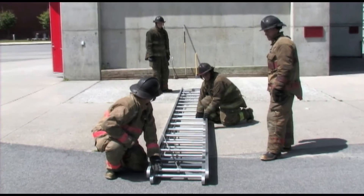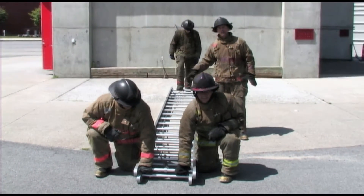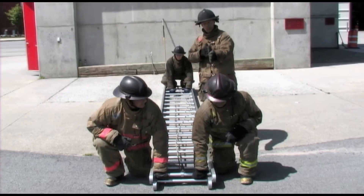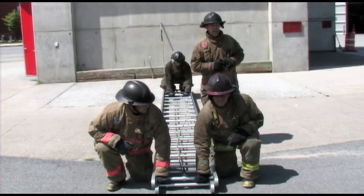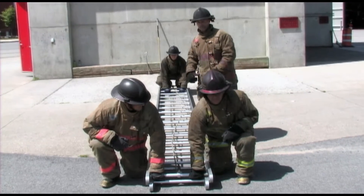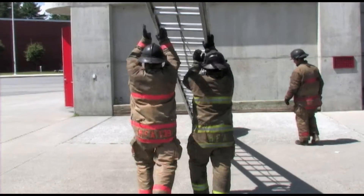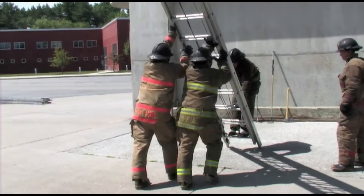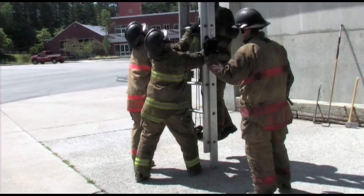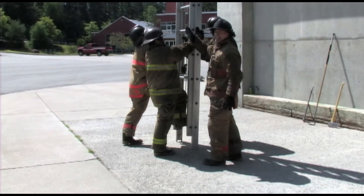His judgment — we're good. When he says we're good, the other tip person will join and get ready to make this ladder vertical. One thing to mention: if this tip person did need to move the ladder one way or another, we don't say lefts or rights — simple big movements. Move the ladder two feet this way or two feet this way, so we do not misinterpret lefts from rights. Make ladder vertical! Now that we have two tip people, it takes teamwork to get this ladder work. Both people need to get in the vertical position — we want to hear two verticals.